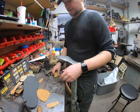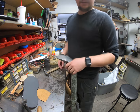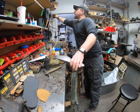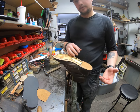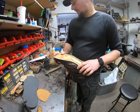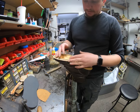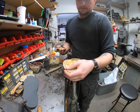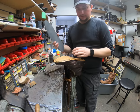For anyone wondering how I measure and determine thicknesses — I use one of these digital calipers. Sometimes I get requests to make the sole thinner or thicker, and there are options for that. With this one we're trying to keep the thickness as original as possible, so I've got the exact measurements. Considering that the Vibram sole we're using today is not very thick compared to the original sole, I don't think I'll need to adjust. It's past hours — I have to leave these to cure overnight with the cork as is and be back in here later to continue.